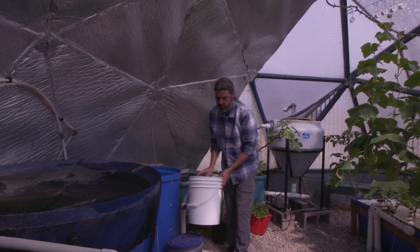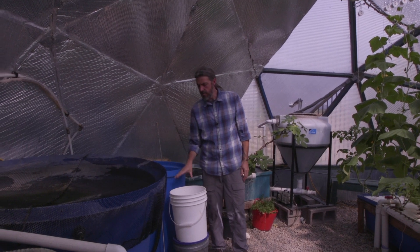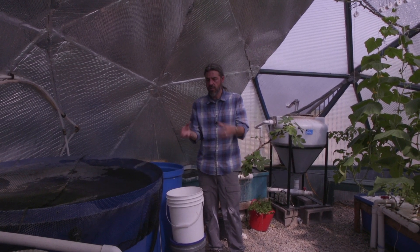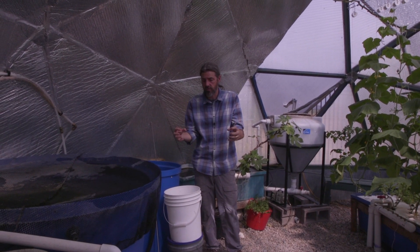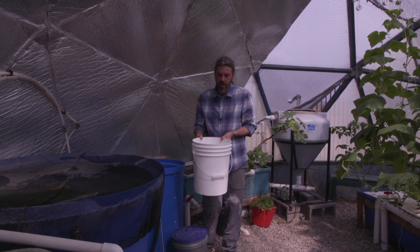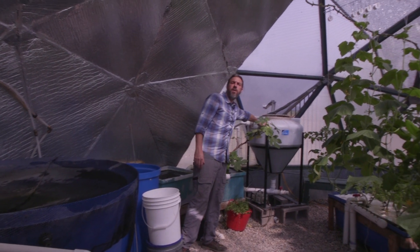There's a lot you can do with this sludge. What we're doing is breaking it down — what we call mineralization. I'm using aerobic microbes to take solid waste and dissolve it, mineralize it into liquid nutrients. What I get out of here is a liquid slurry, and I take that sludge and put it into an aerobic septic system.